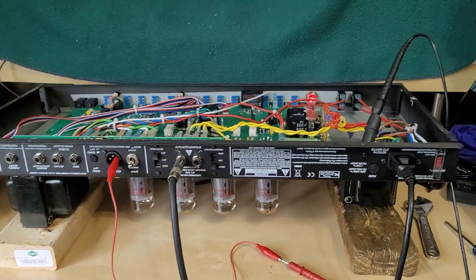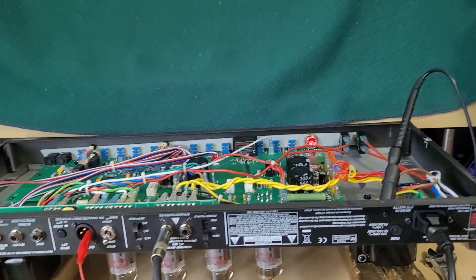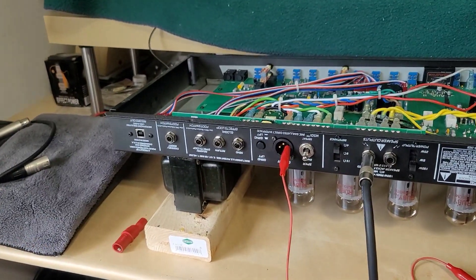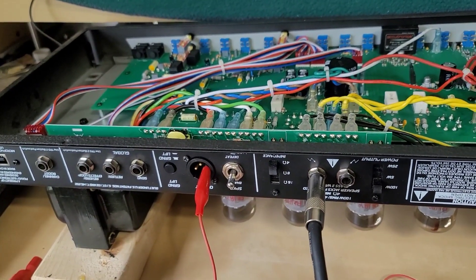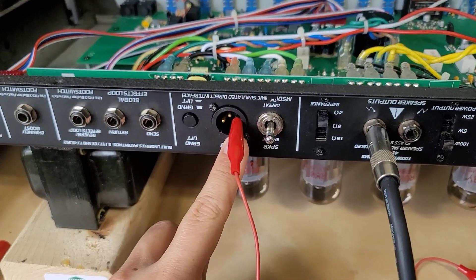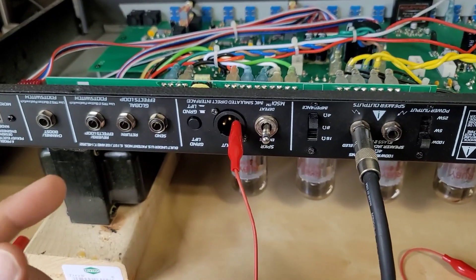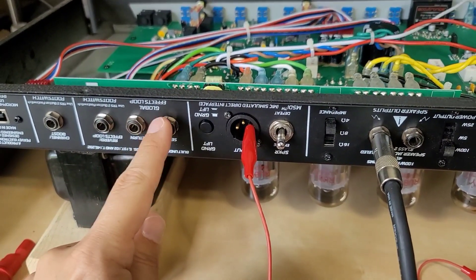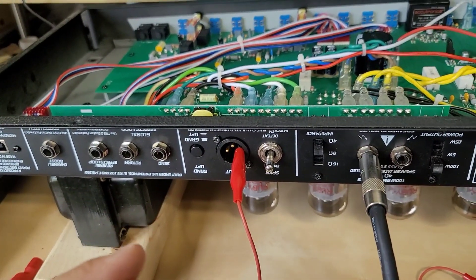That is a ground loop that you're hearing through the speakers. You wouldn't really notice it if you had an XLR connected to the mixer or anything going to front of house. What's happening is this patch board behind here has got a problem — it is isolated from the chassis ground. Over here is your ground lift switch, and all that does is take pin one and lift it from the chassis to prevent any ground loops when connected to a mixer. This patch board has isolated jacks with a plastic shaft and metal nut, so there's no continuity from the shafts to the board for chassis ground, and that is the main issue.